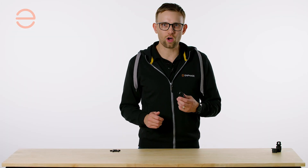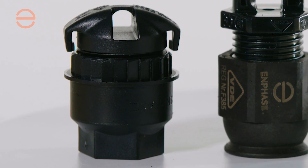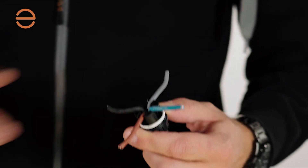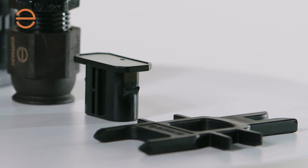The multi-phase iQ terminator also consists of three parts, but the assembly is slightly different. We again have a terminator body, and the rubber grommet is inside the middle piece. When assembling, there is a little edge in the middle part to make sure that the wires only go as far as they need to. You can then fold them over, cut them around the edges, and put the covering on top. This in essence completes the seal.